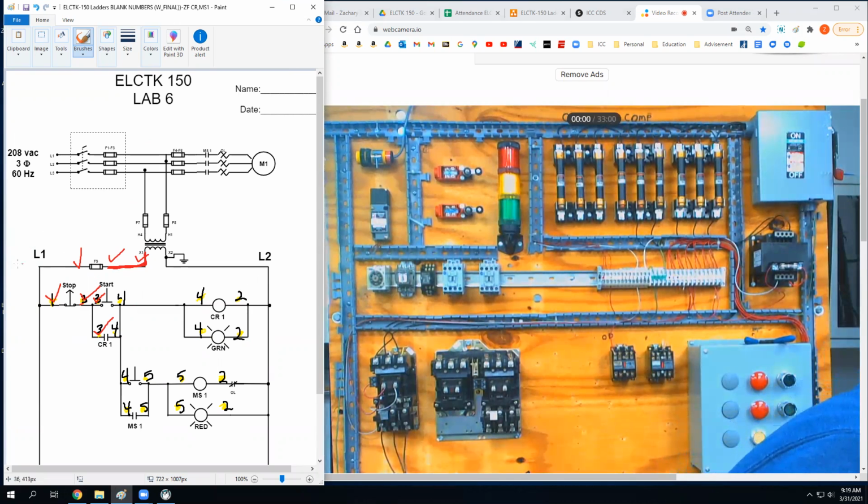But there's also things that aren't on here called rung numbers. So this would be rung number 1, 2, 3, rung number 4, rung number 5. Over here on the right on prints, you will see in parentheses, this one would be a 3. What do you think that represents? That's exactly right. On this rung, it's telling you that there's a relay on here, and associated with that relay coil, you will find contacts on these rungs. So on rung number 3, there's a normally open contact.